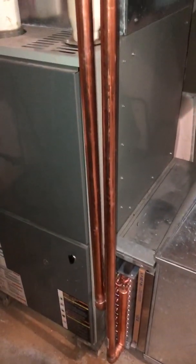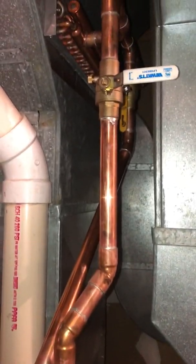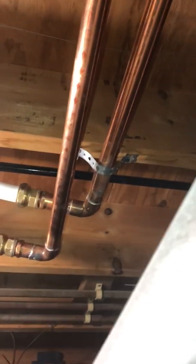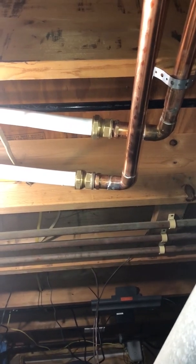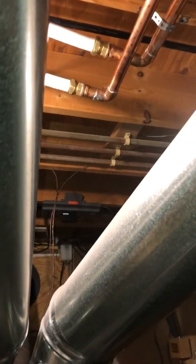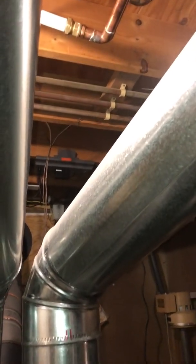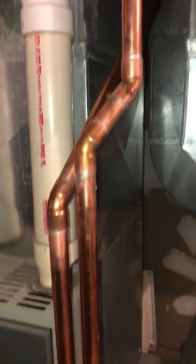And it's just 1 inch copper connections. The two exchangers are connected in parallel. And if I get back far enough here, we'll see where I connect to the 1 inch PEX, aluminum PEX tubing, and that goes all the way over to the boiler shed. That's what's down in my trench. The lines are down in the trench. I used the foam in trench method.